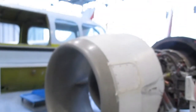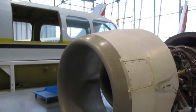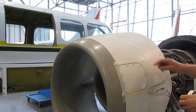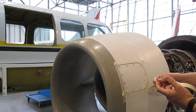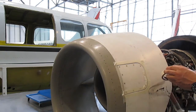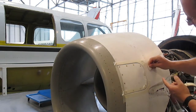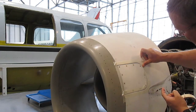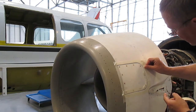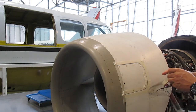I'm going to show you how to do outside curves. What I'm going to do to cover this edge is cut little pieces — rip a little piece, go at 45 degrees, keep it back a little bit from the edge like that. Get another little piece and keep it about the same edge distance. Another little piece, so again I end up with something that looks super professional when it's done.